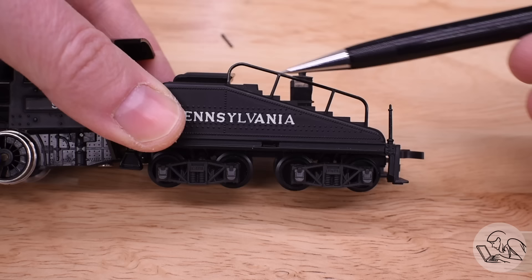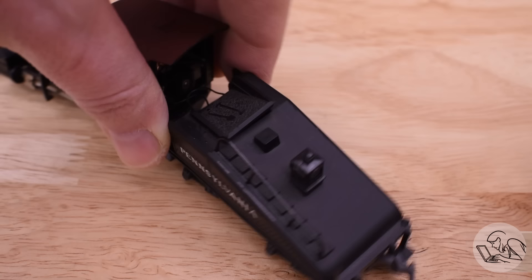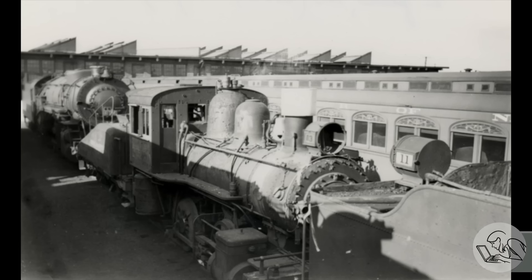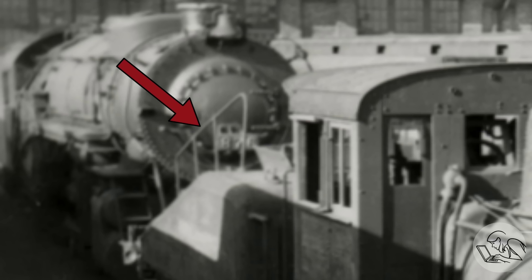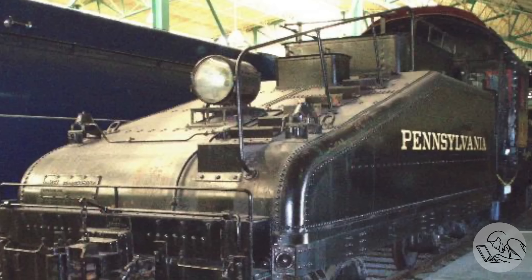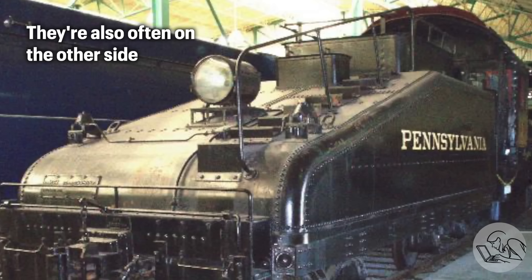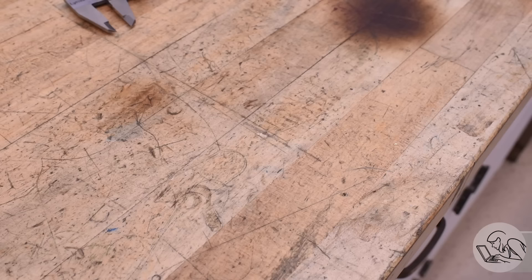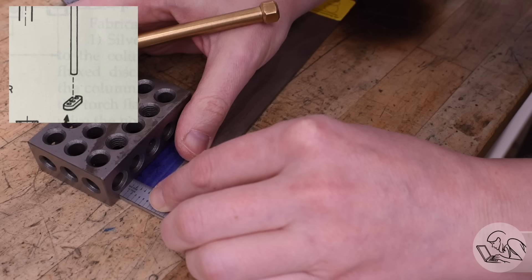When last we left our tender it had a rather sharp set of stairs, but what it's missing is a hand railing alongside those stairs. Looking at the HO model, the center stanchions are perpendicular to the railing but the end ones are at angles, so it looks like the spacing is uneven. On the prototype the railing design varies quite a bit from A3 to A3. The most common arrangement — as shown in the HO model and in Kozo's drawings — has the railing stopping a couple of feet short of the bottom of the tender, which makes that first step a bit of a climb for the crew.